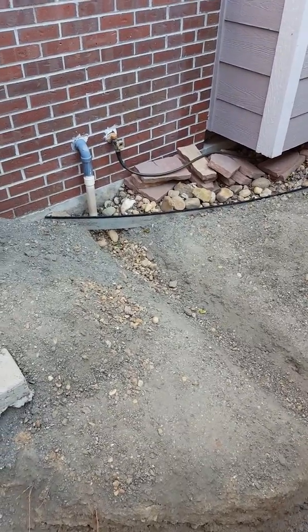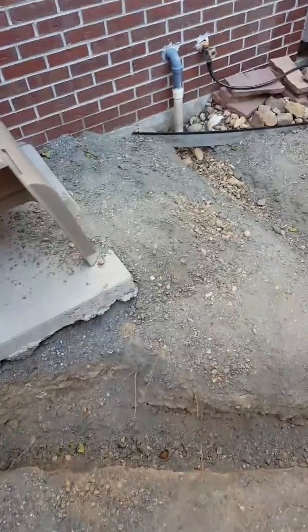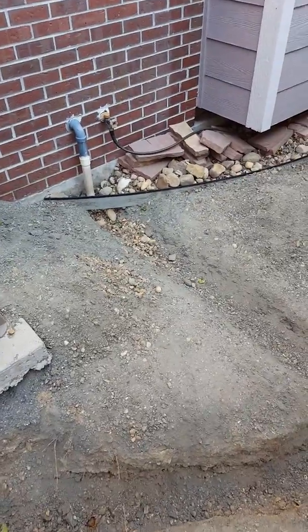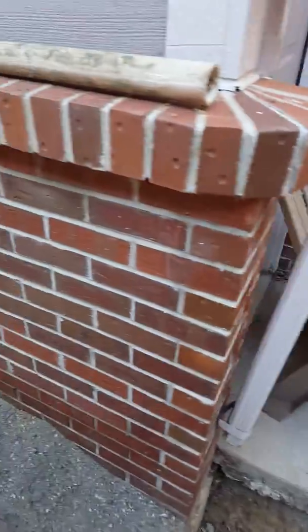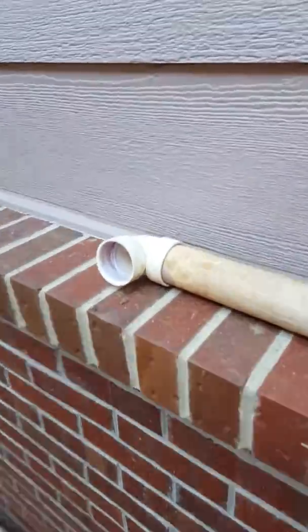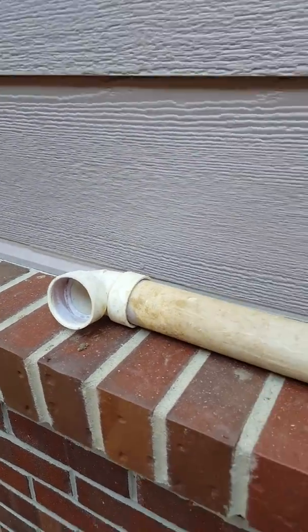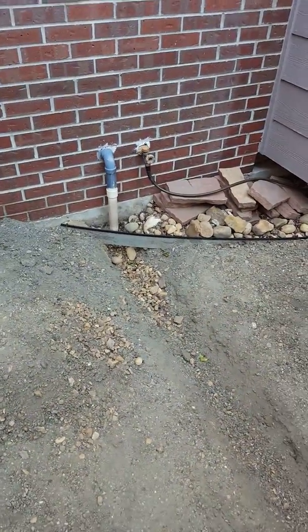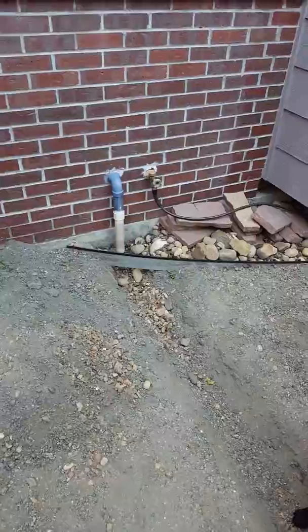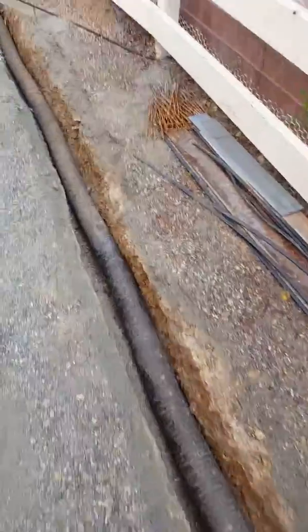That sump line needs to be pretty much free and clear. Found that out during the flood rains two years ago. The other problem was I had set that line in using a straight 90° elbow at the end instead of a double-L and angling it properly. That weld fractured. I've got my excavation assistant here.